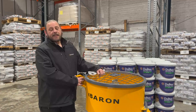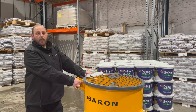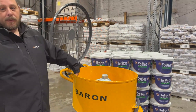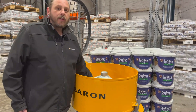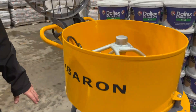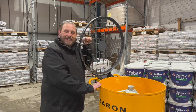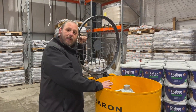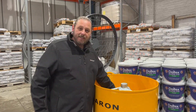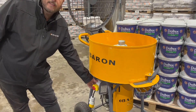When it comes to winter, it's time to start thinking about the maintenance your machine may require. Is the lid stable and fixed in place? Does your positioning bolt work well? Make sure your drum is clear and free of any resin before you put it to bed for winter. Do you need a new set of blades? This would be the time to order them — don't wait for the day before the job. Did your switch work properly, or would it be time to buy a spare to keep in the van? It's good practice when purchasing your Baron mixer to order a spare set of blades and a spare mains relay in case that ever needs replacing on site.